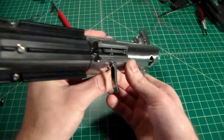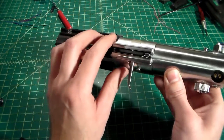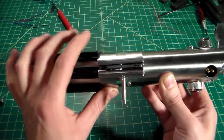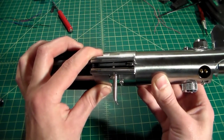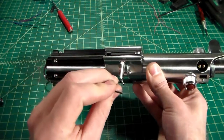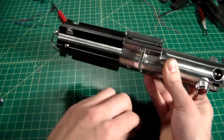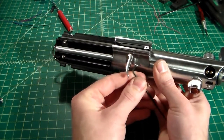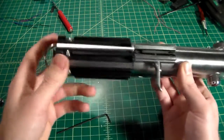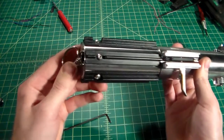You can do it this way too. You can sight down the back side of it. Just line up the clamp. You can look through the space here and see the notch in the shroud, which is also 90 degrees. You can line it up like that, and then tighten your screw down to lock the clamp in place. Give it a good little snug, and now we can line the grip up again with the clamp, just like that. Our D-ring is nice and lined up,